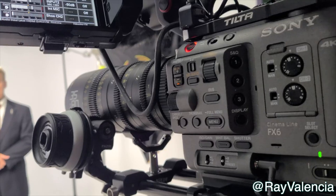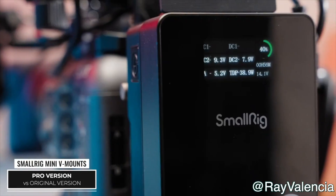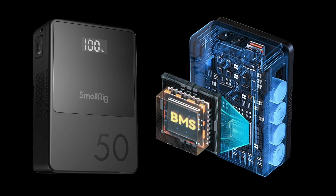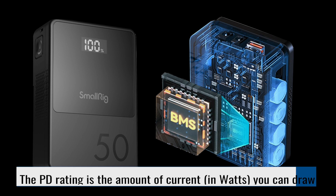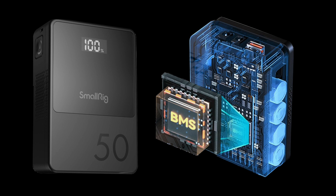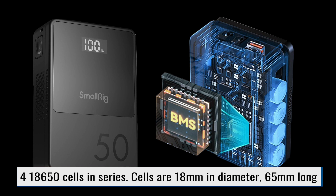V-mount batteries are widely used in professional settings, particularly in the film and broadcast industry, due to their high capacity and versatility. V-mount batteries come in different configurations which determine their capacity and overall performance. The available interfaces will depend on the particular battery - even within the same brand, these interfaces and available voltages and power vary. In general, the larger the battery, the more current is available. You will need to check these specifications thoroughly to understand if it meets your particular requirements. Each battery may have its own quirks. For example, on this battery model, if you draw 5 volts from the USB-A port, you may only draw 5 volts from the USB-C port concurrently. The 50-watt-hour batteries are usually four 18650 lithium-ion cells connected in series with a single parallel group.